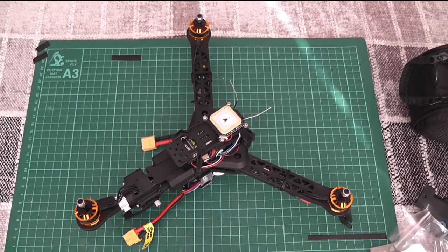Other problems I encountered: I've got a FrSky D4R2 receiver and I was going to feed the flight controller board with combined PPM, which that particular receiver is quite good at doing. However, if you look on Google you'll find that the APM board loses sync with that particular receiver, but there is a firmware upgrade available to give you full 8-channel combined PPM with a full sync pulse. That required a firmware upgrade of the receiver, and I found that an FTDI board could be used — I had one already.